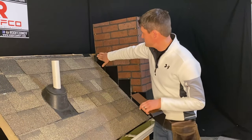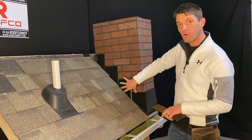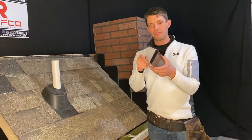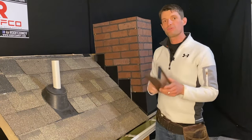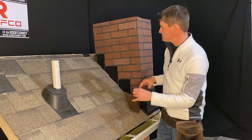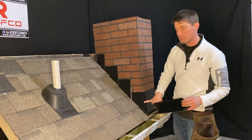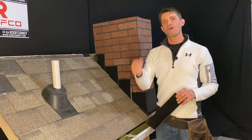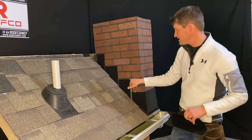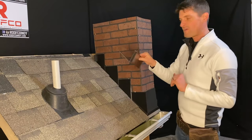We are wrapping up our chimney project. As you can see, we've got all of our mortar joints ground in here. Each piece of step flashing is going up two courses of brick, and we've got masonry nails driven in to hold it in place — everything is 100% a mechanical seal here. Next, we're going to put our top pan on. This is a rather intricately bent piece of aluminum. It needs to adhere to the pitch of the roof and needs to be the width of the chimney. It takes a little bit of time and patience to put this together the right way, but this is definitely the right way to flash a chimney. We've got another one-inch wing sticking out up top to create the same type of mechanical seal as we did down below, so at every corner you won't have to worry about a bead of caulk or a nail coming out.